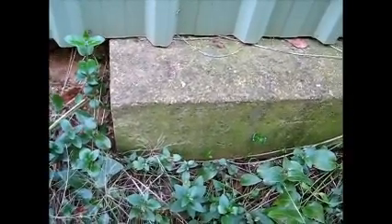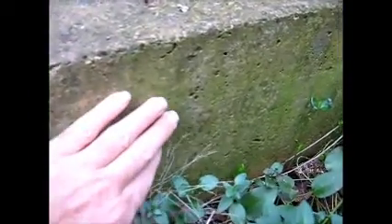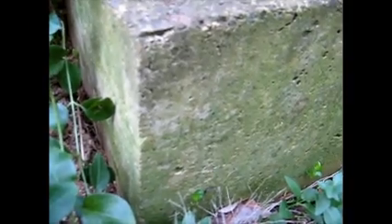This was the first concrete formwork we did 25 years ago for our garage, and we used the smooth oil method for that lovely smooth surface. See how smooth it is? That was our first experiment using grease on the boxwork — and it's still nice and strong after all these years. But at that stage we didn't know about putting silastic or putty down the corner of the box, so you've got a much sharper box corner there. That can be avoided by putting putty or silastic in the corner of the box.